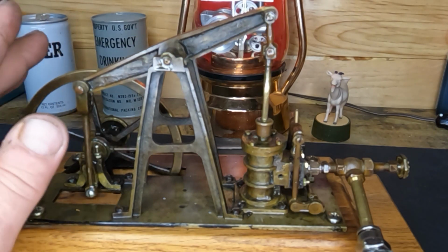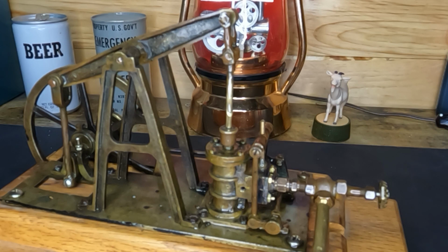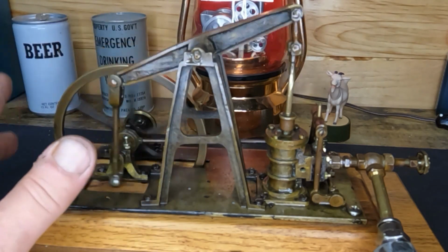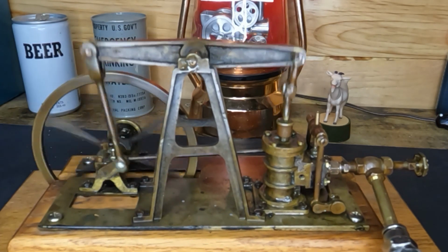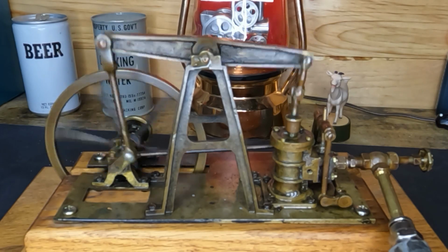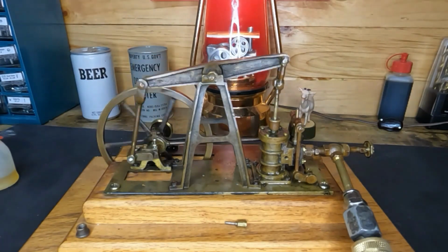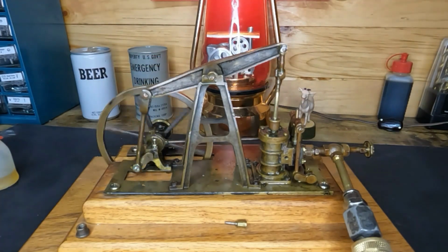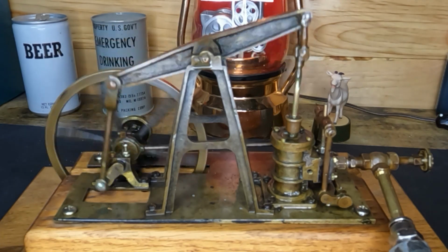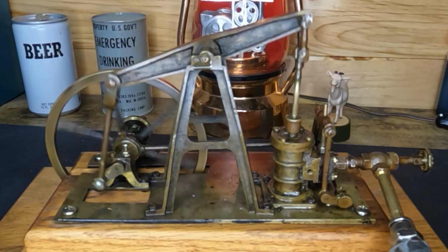We're leaking. Now our slide valve just went ahead and caught, and if you can see down here, it's bubbling. You can't see it. So we do have a leak at the top, but that's expected because our packing nut's right here. Our exhaust beads are nice and even. Other than the rattling and the knocking sounds that we still have, everything is sealed up here in the front, with the exception of this packing nut on top. But we're going to get to that.